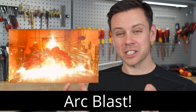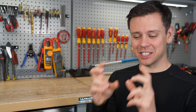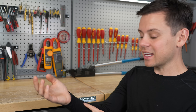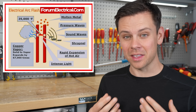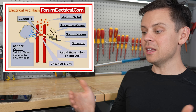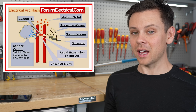So far we've only talked about electricity going through your body, but there's something probably scarier: an arc blast. This is a literal explosion caused by an electrical fault. For example, if you have a high voltage battery with large conductors and you cause a dead short, the energy released in that space creates an explosion so powerful it generates pressure waves that can throw people back. It creates so much light that everything around you — including yourself — is burned. You can get second and third degree burns anywhere that light touches. The temperature is so extreme that nearby copper can be vaporized and you can breathe it into your lungs. Surrounding metals that don't vaporize become shrapnel flying in every direction. Anyone looking without protective equipment will be blinded. There are pictures of people affected by arc flashes online — they're pretty bad. They still haunt me.